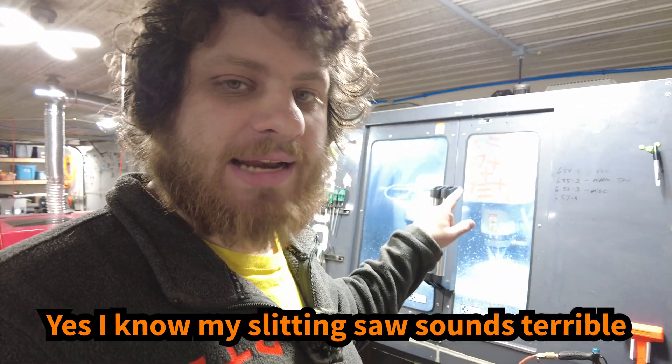I made the CAM changes, put a new tap in, and started it. Right now it is slicing off the part so it can start with a fresh slate on the next batch. There wasn't really much I could do to keep the tap from breaking, so all I did was make the tap hole just a little bit deeper, and I also stuck the tap out more when I put this one in. My theory is that would give it better coolant access, which would hopefully help it not break. If that doesn't work, my only option is to try buying a form tap — a little bit more expensive, but if it works, it works.